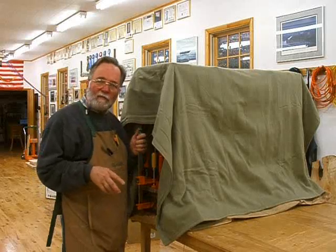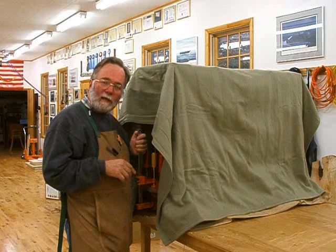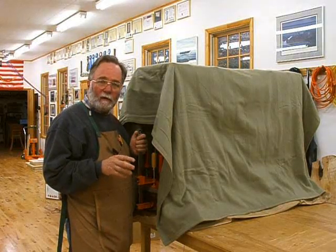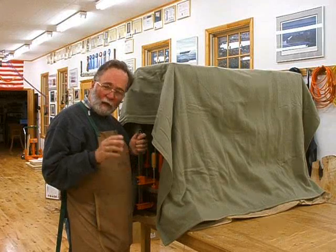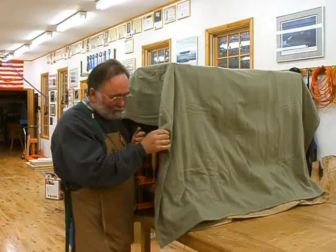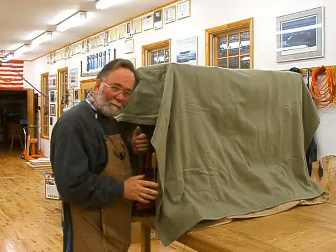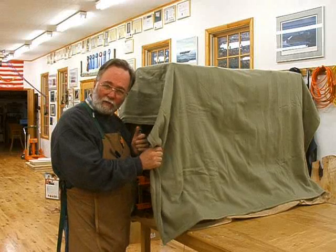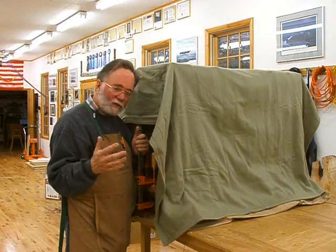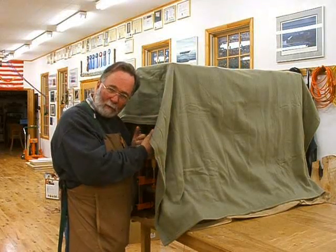It's November here in Virginia and it does get kind of cool. Unibond 800 needs to have a temperature of at least 65 degrees Fahrenheit in order to cure properly. I know that that's a fact. Don't ask me how. I've got an electric blanket here that I put over my clamp-up, and I'm going to go ahead and just leave this turned on through the night. As the temperature drops in the shop, this nice little tent will stay warm and the Unibond will cure.